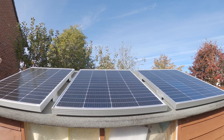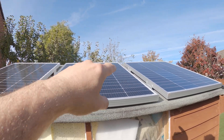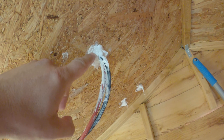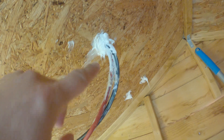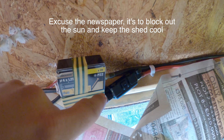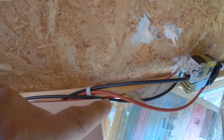Here are the solar panels — there are three of them, 120 watts each, so 120, 240, 360 watts total. The wires come in through the roof, and I've been cautious by putting weatherproofing material here to stop rainwater coming in. The wires come down and they're fused separately, so the positive and negative of each panel has a fuse in them, just to be on the safe side.